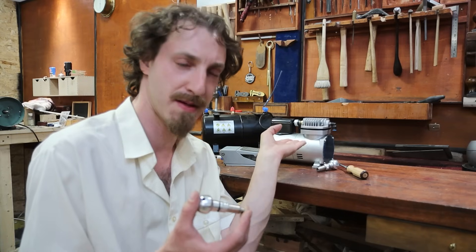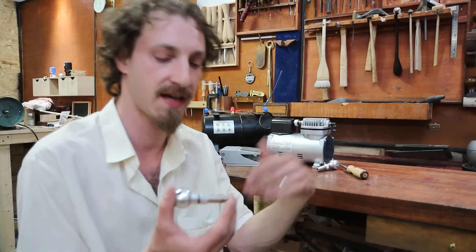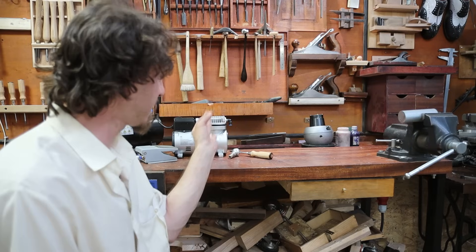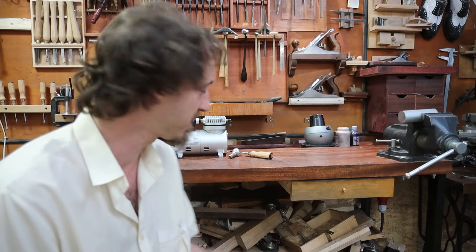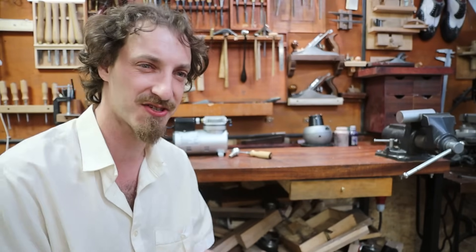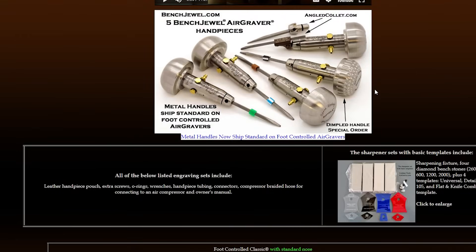The modification is just to remove the valves inside the piston system, which allows the piston to push and pull air all the time to make the graver resonate and do its hammering. Now it seems that this compressor is either too weak — which is quite possible as it doesn't feel very strong — or this method is just mesh. There is a different engraving system that was patented by Steve Lindsay, which avoids all these shenanigans and basically can function on just a constant airflow from the compressor.